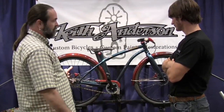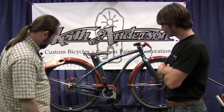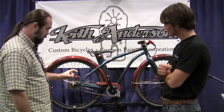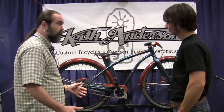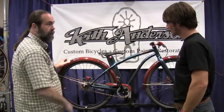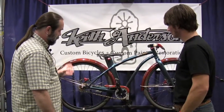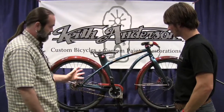So it started that way. I actually built the frame backwards — I made the fenders first. The fenders are 13 plies. It started out as eighth-inch thick strips, two and a half inches wide. I formed them around a die by boiling them, and then I laid them up with epoxy resin. Then I had a big blank and I had to carve that out — I used a router. And then the seat tube, the bottom bracket, and the chainstays were next so that I could fit everything in.